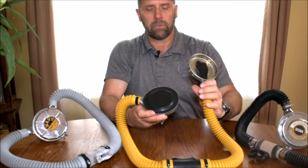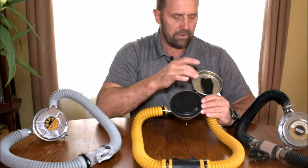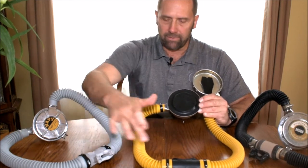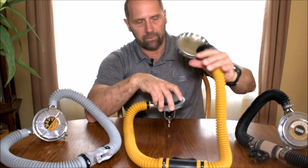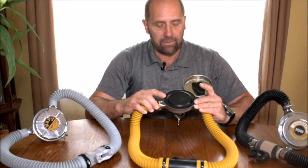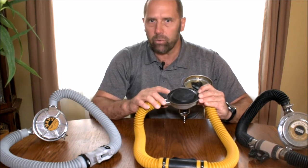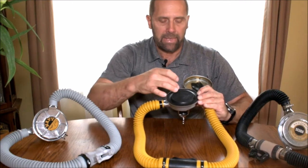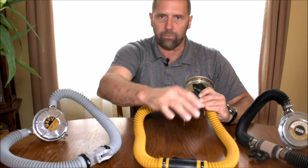Taking this apart to show you a couple of the parts inside — the main diaphragm and the exhaust diaphragm. Again, the air comes in this side, that's what's hooked up to the tank, and it goes out that way — that's your exhaust. I'm going to breathe off the regulator. You'll see this diaphragm collapse into the bottom box. That would, if there was a tank hooked up to it, activate a couple of levers in here and cause air to flow through the system.